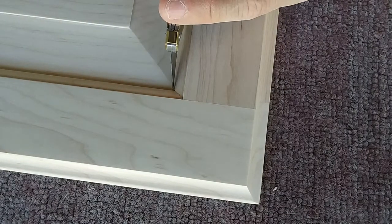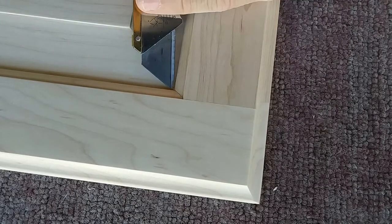One last step is to clean up any excess glue or little bits of wood in the corners of the stiles and rails. A razor knife, exacto knife, or even a chisel works well here — just work delicately. A heavy hand can cause more harm than good, but with practice you can end up with clean, sharp corners. And once that's done, your door is ready for the finish of your choice. A little math, some sharp bits, and some light passes are really all you need to put together a raised panel door. And even with the few setbacks I had, in the end the door came up pretty well. If you like this video, give us a thumbs up and maybe share it with your friends. If you haven't already, think about subscribing and hitting that bell so you get notified every time I put out a new video. If there's something you think I could have done better, smarter, or safer, please drop it in the comments below — I'd love to hear what you have to say. Have a great day, take care, we'll see you soon.